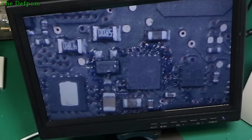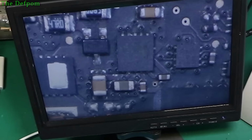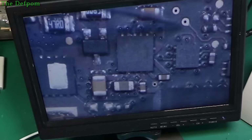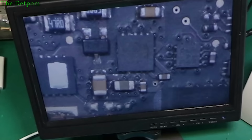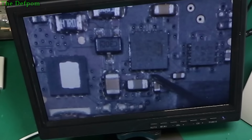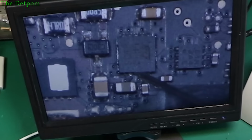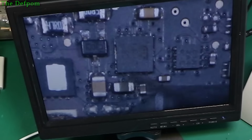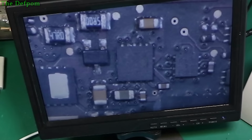But if I get one of my donor boards here, this one's intact in this area, so it's not been touched. Okay, so there's a cleaner view, you can see a lot better there. So there's that via I was talking about, there's that pin, and there's the other pin. Turn it up slightly, you can see, just there, and it's linked to these chips here. Right, so I've got voltage here, around there. For some reason it doesn't go straight across the board like that, which is a bit weird. It goes through a via. I don't know why it's done that. Anyway,